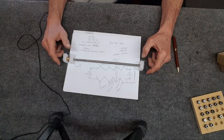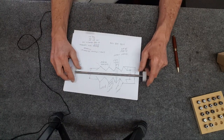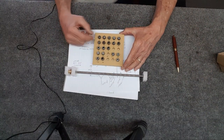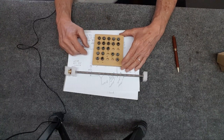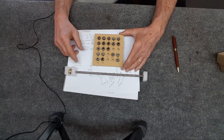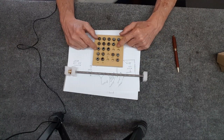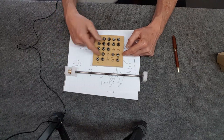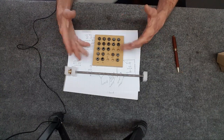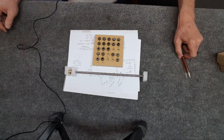Okay, so that's all I wanted to say in this video, primarily a new thing. I did remachine, you can see this guy, the ER11 holder, because the sizes I had handwritten in were kind of cheesy. So I pulled the old program up, said redo all the holes, and then exported that as a DXF, pulled it into Lightburn, put all the text underneath each hole, deleted the hole pattern, the DXF, and said burn it. So it came out really nice. I'm very thrilled with it and where I can go from here.